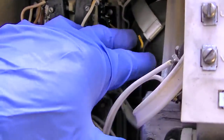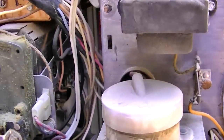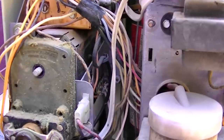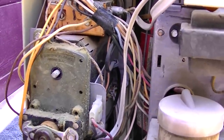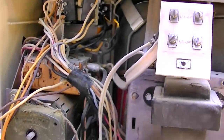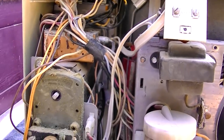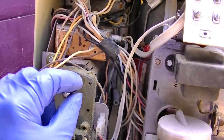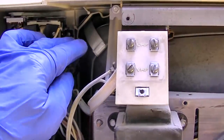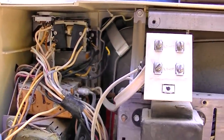So what this wire does, if you didn't catch it over all the noise, is there's got to be a way to do it. I just don't know how, but because it's a remote set, you don't want static when you're going from channel to channel on a ratchet tuner. So there's a mute that grounds the audio line and shuts the sound up on dead channels. I think Zenith had it where there were 13 little things on the back and you turn them and it would just skip over the dead channels. But we don't need this because this is never ever going to be used as a remote set again. Maybe volume up, volume down.